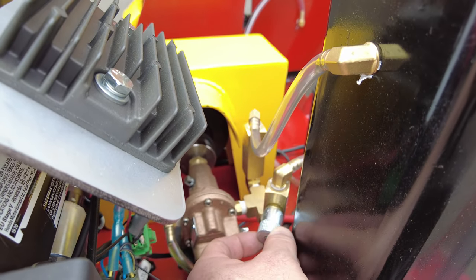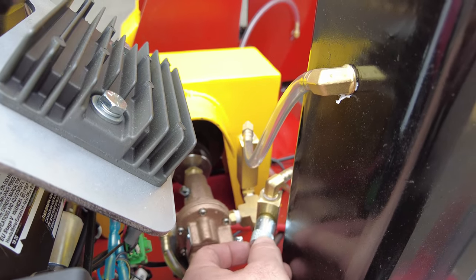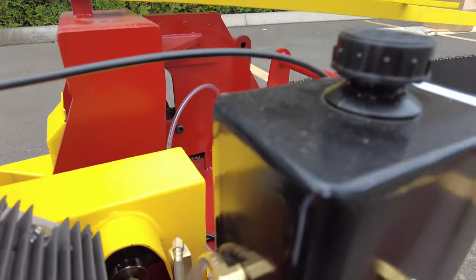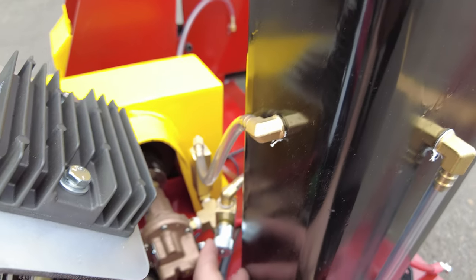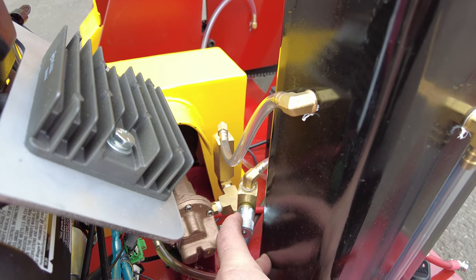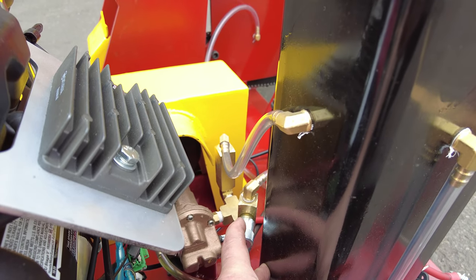The ideal condition is really set by both ear and how much oil ends up in the chain itself. Given the viscosity changes, ambient temperature, and everything else, we can't set this to a standard flow or a standard position and have it work for everybody.